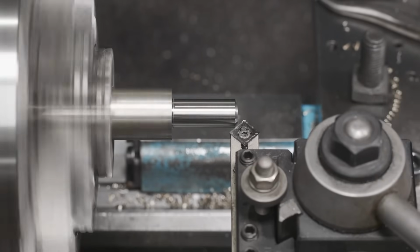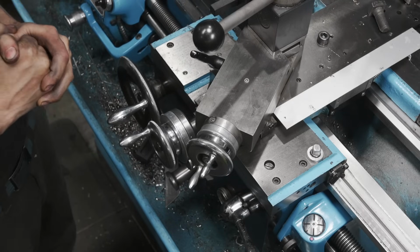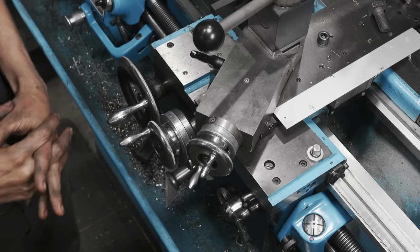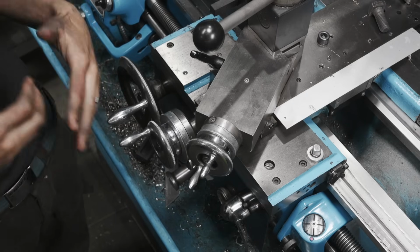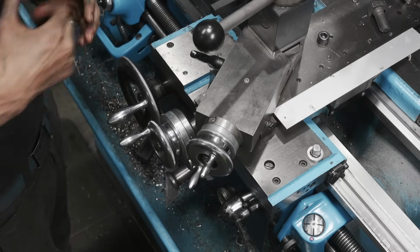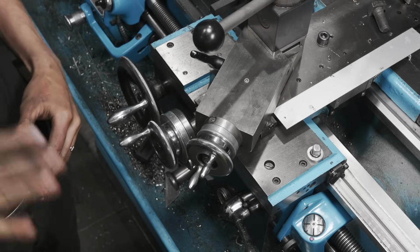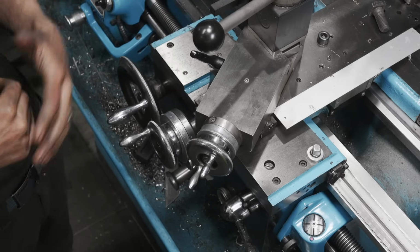There we go. I wanted to bring you along and show you how I'm working the dials on the lathe. Now, I'm gonna be the first to admit that when you're cutting threads, there's a bunch of people that are very passionate about the right way to do it. And let me tell you, there's many ways to do it. If I'm being honest, most times when I'm cutting small threads on softer materials, I just cut it over here with the top slide and it works out perfectly fine. It's less stuff you have to deal with and it works great.